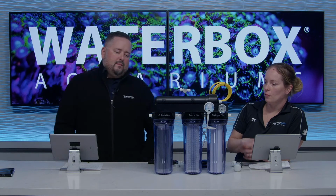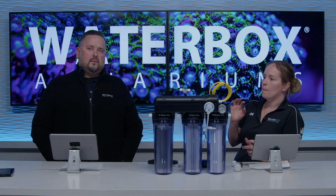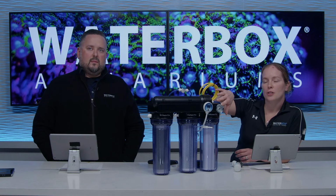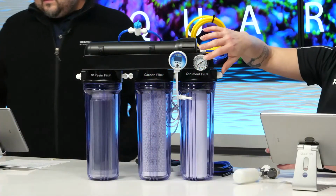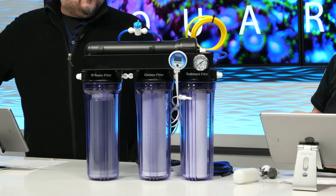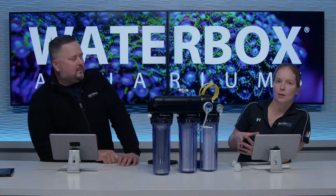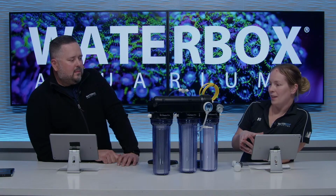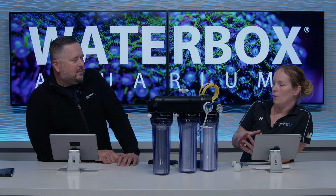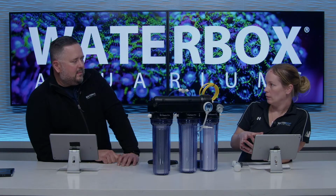A few things that come on an RO unit that are very important. Let's start with your pressure gauge. The pressure coming into your RODI unit is going to determine the effectiveness of it. The very minimum water pressure that you should run through an RODI is 40 psi. You don't want to be at 40, but you can get by at 40. 80 is the perfect level. 60 to 80 is okay.